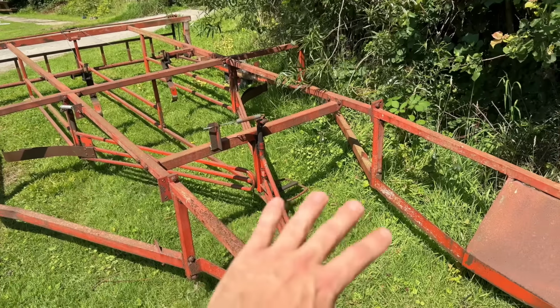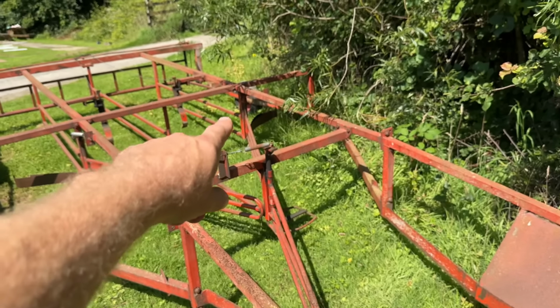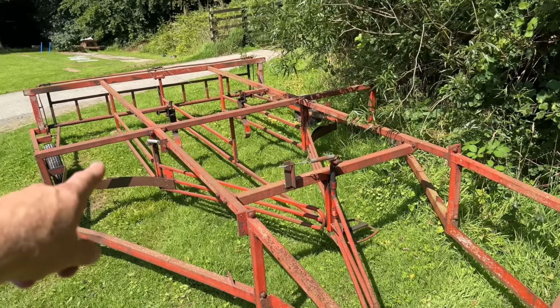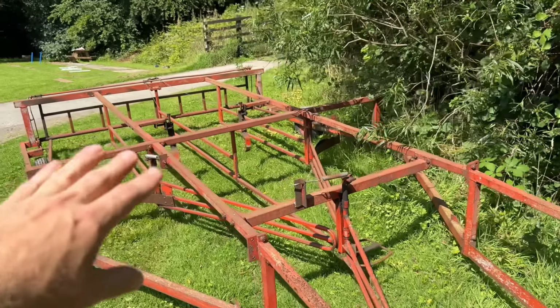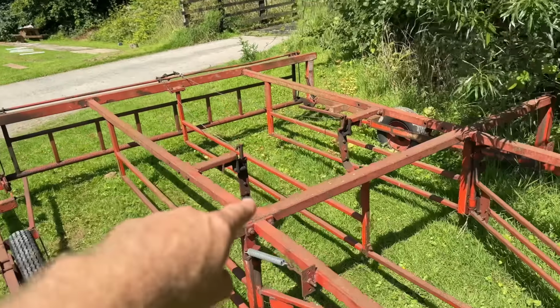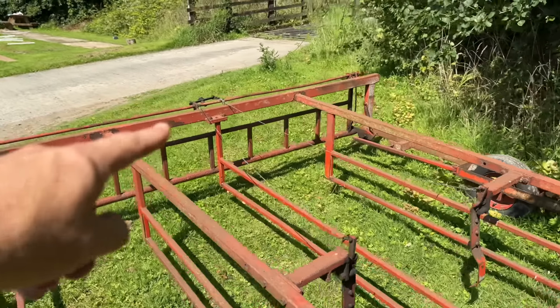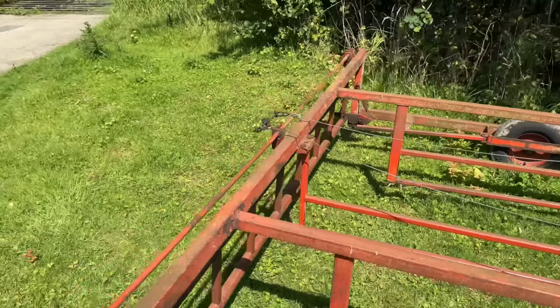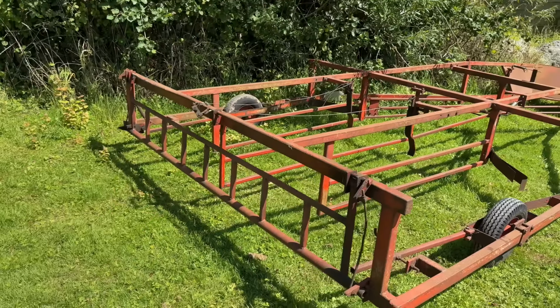Now, generally speaking, just a quick explanation: the bale drops into there, it will go down there and fill two into that side, then that'll flip over and it'll fill two into that side, then two into there and then two into there. And then once these two flaps here open, one, two, once they're pushed up by the bales, they'll automatically open the back of the bale sledge. So then that will open up and allow everything out.